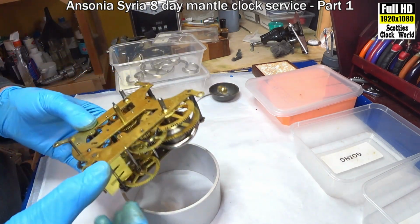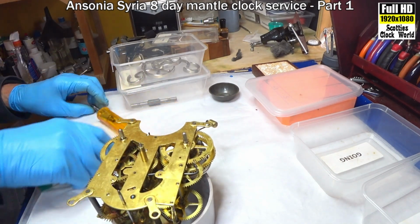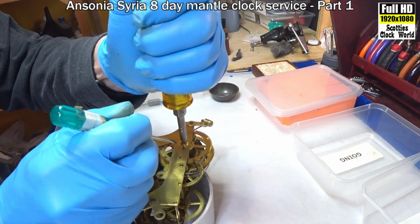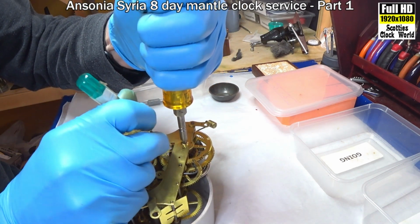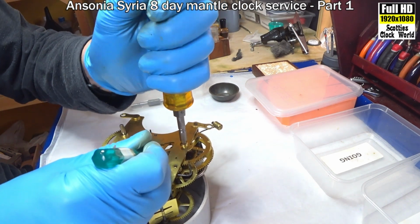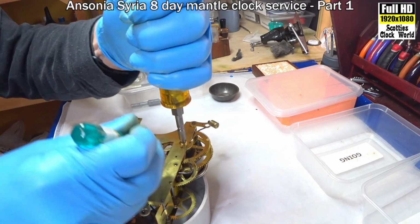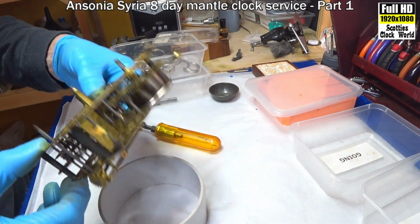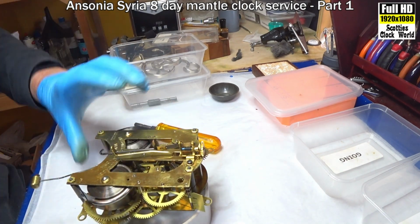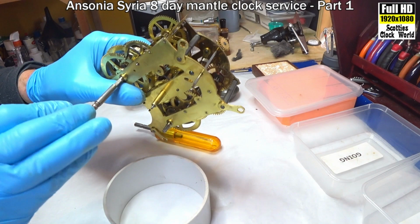Right. Now we'll let down the spring, once again, the letdown tool. Put some pressure on it, as if you're going to tighten it a bit. Screwdriver under the click, hold it out. Let the letdown tool spin round. I think the clamp has moved a bit. Yep, we'll have to tighten that up a little bit more. It's down the bottom, we want it in the center.